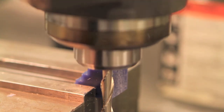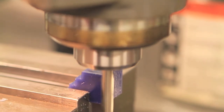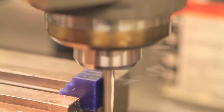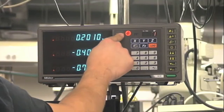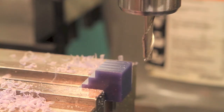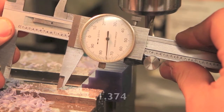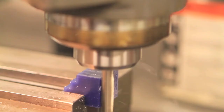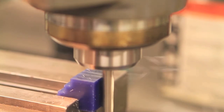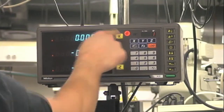Similar to the right side, we need to lower the quill and plane the side until it's square. Reset your X axis, then measure the width of your part — in this case, 1.374 inches. Subtract your target to calculate how much more needs to be removed: one hundred and seventy four thousandths. Moving the part right, shave off the calculated value. The base of your part should now be the proper width, one point two inches. Reset the X axis.